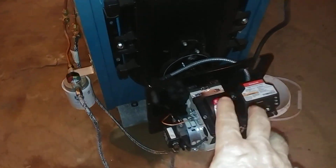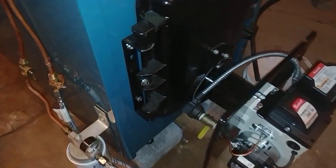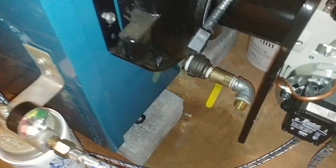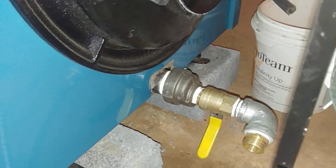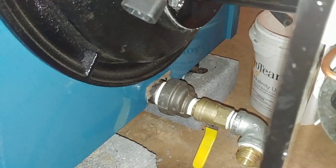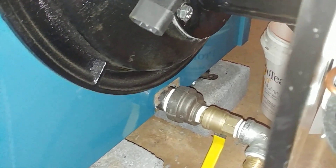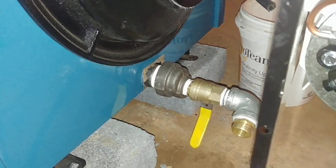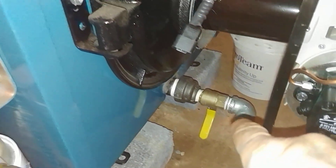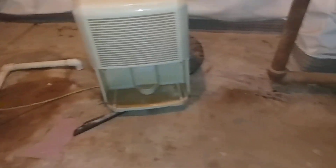This gets a cover. The oil burner has been mounted. There is our front drain — that's inch and a quarter shoulder extra heavy with an inch and a quarter by three-quarter eccentric coupling, a full port ball valve, and the drain which can then be sent to the sump pump.